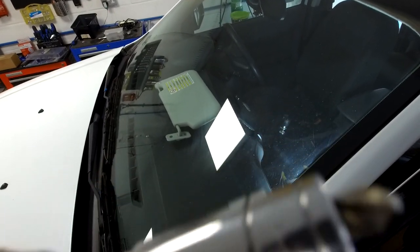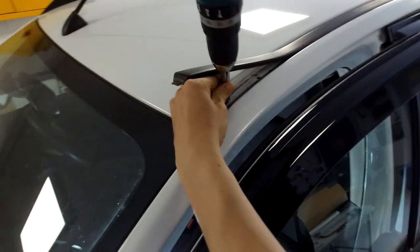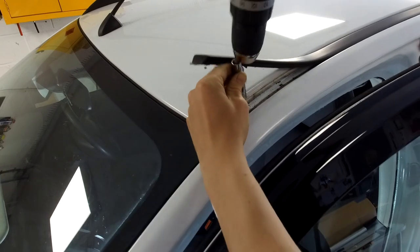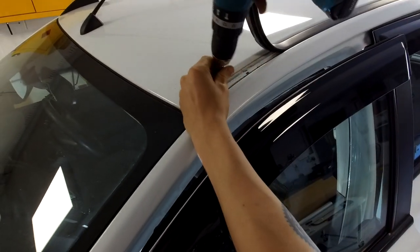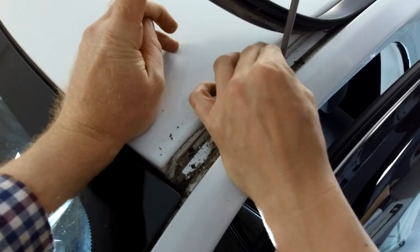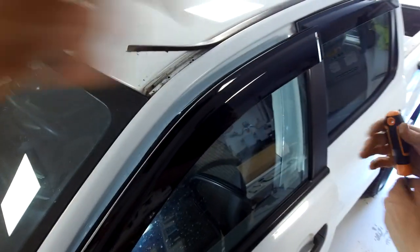To make sure we don't drill too far, we've made an ingenious drill stop using a long-reach socket from the socket set — it only leaves a bit of the drill exposed. We've now got the two holes drilled. We're just cleaning up with a file. We may have to elongate them slightly as they wandered a little bit, but we can check that once all four are drilled.